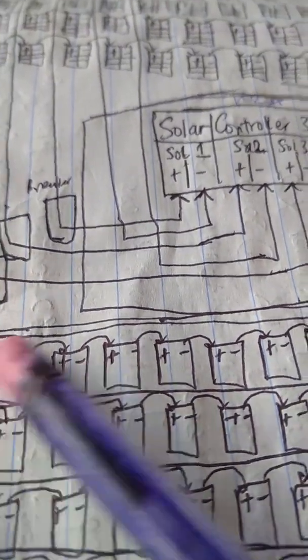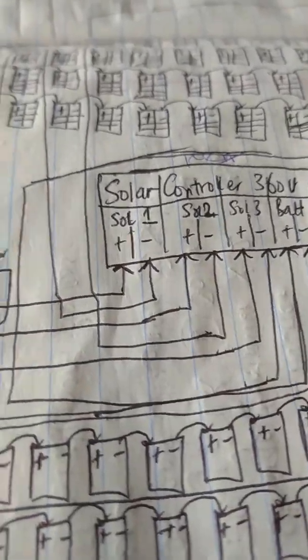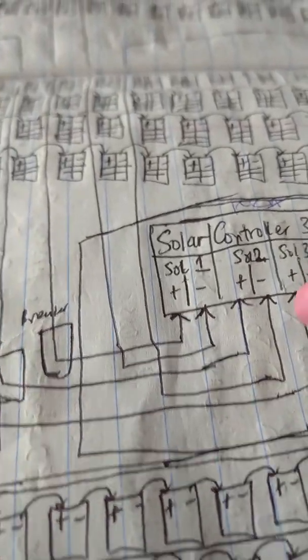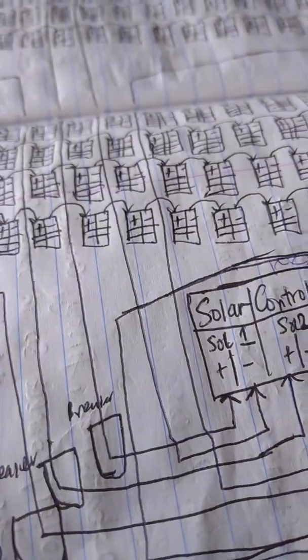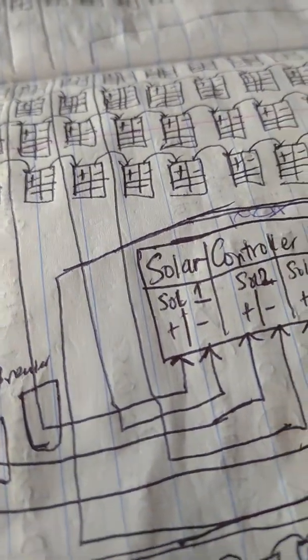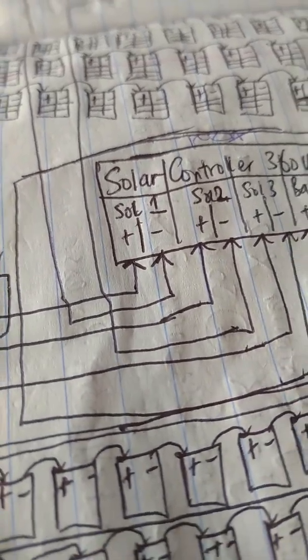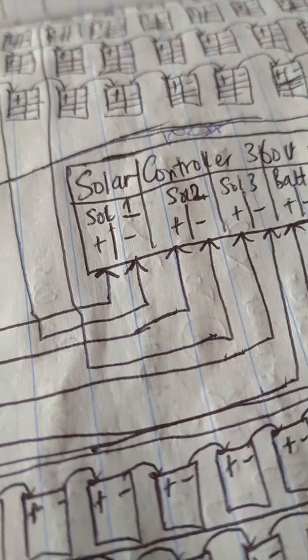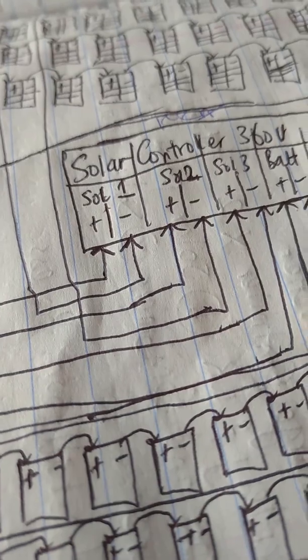These are the batteries — you can see them connected in series, then parallel. Parallel them and it will give you what you want — a 108 kilowatt power bank. After connecting them in series, you read it with your clamp meter and volt meter, check the voltage. Normally your inverter should be 360V DC input, so you have 30 batteries at 12V each giving 360V.